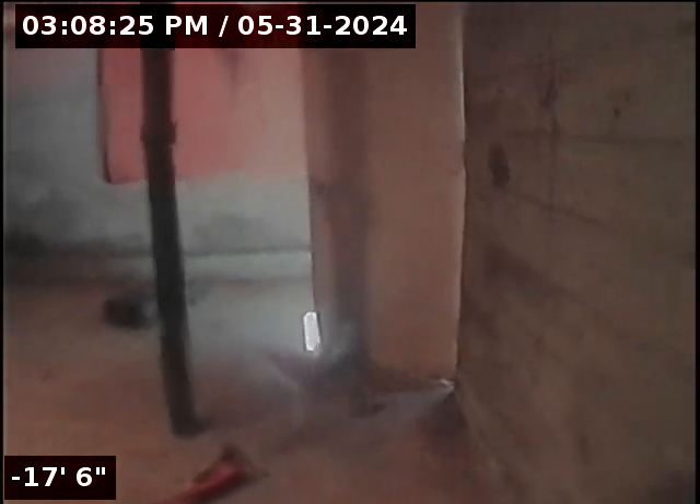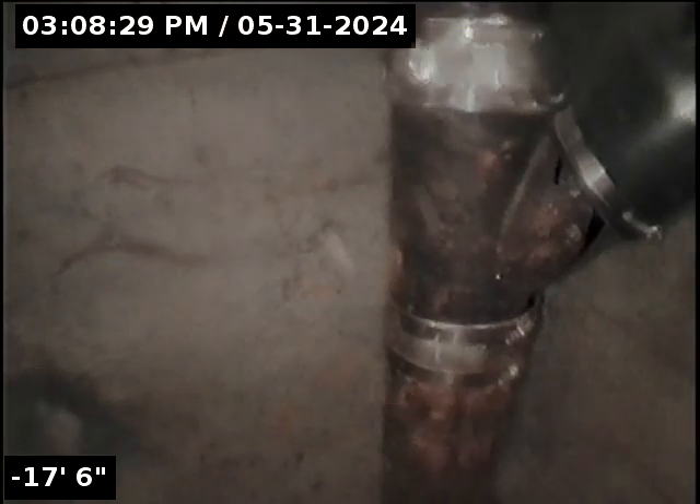There's also a clean out right here in the floor. What I'm pointing out right there, right next to the doorway, is a clean out for this piece of pipe. What these lines are doing here — realistically I think this takes place on the exterior, but it may happen under the basement floor. This pipe right here runs over to meet up with that one; they wye connect together and then shoot off down the back hillside. This spot right here would appear — I'm not going into it, I don't know for sure — but it looks like a straighter shot from that point. Sometimes when you go through a spot that has a few turns in it, the way it pinches the camera going around turns can sometimes articulate the camera up against one side of the pipe wall or the other, where going into something with fewer turns can allow the camera to remain in the middle of the pipe.